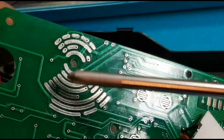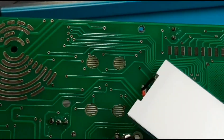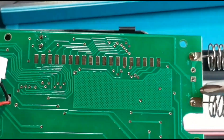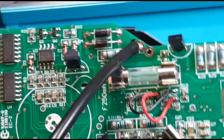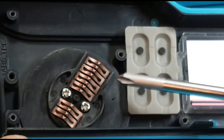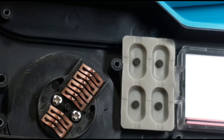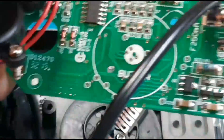On the other side of the PCB, starting off with the rotary selector tracks — they look fine, it looks like tin, fairly well spaced apart. Here we have the LCD inputs, just part of the LCD display on this side. Of course, those are the coil springs to touch the battery, and the soldering job is kind of so-so. All in all it's okay, definitely nothing to get ultra excited about. Going deeper inside, here is the actual rotary selector switch itself — a total of six switches, screwed in by two Phillips to the selector knob. The buttons have a nice rubbery, tactile feel. Here's the Zebra or Elastomer, which feeds the LCD display. Standard ABS on the inside.